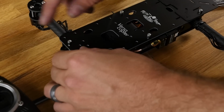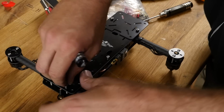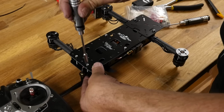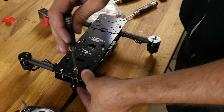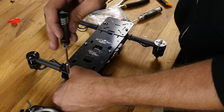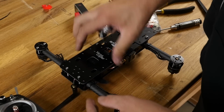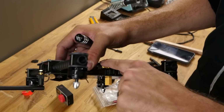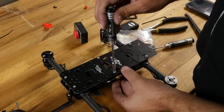Now we were talking about how you can do all your settings here. You change your multi-rotor type, you can change your PID settings, you can change your attitude settings. If you activate channel 5 on your MZ12, that is your rate mode and your angle mode, we'll do that right before we fly so you can see both modes. And you can see I really don't need to have a 2 mil bit on the other side because it's threaded in here. It actually locks down beautifully.